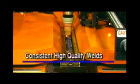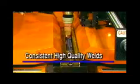These exclusive features are designed into every ME zip welder. Consistent, high-quality welds: since both coil ends are clamped flat prior to shearing and held throughout the shearing, indexing, and welding operations, the joint fit-up is always repeated. Since the fit-up is automatic, there is no margin for operator error.